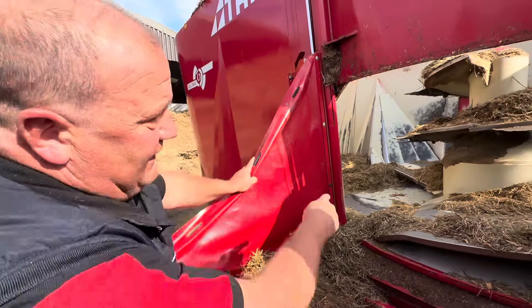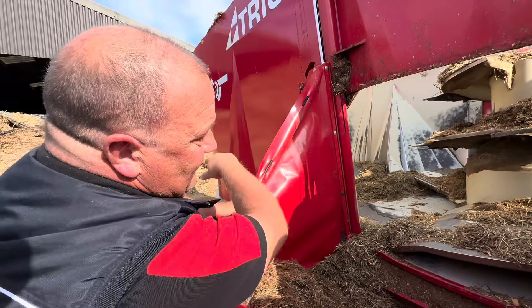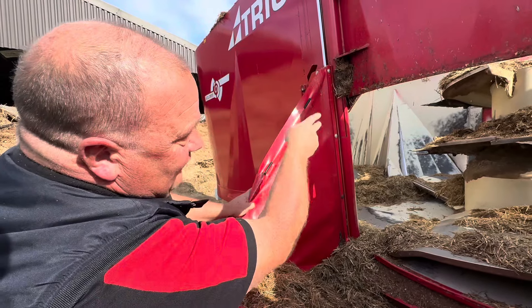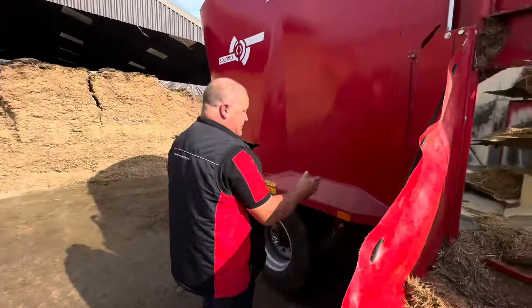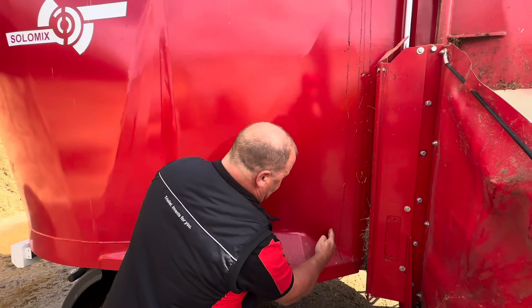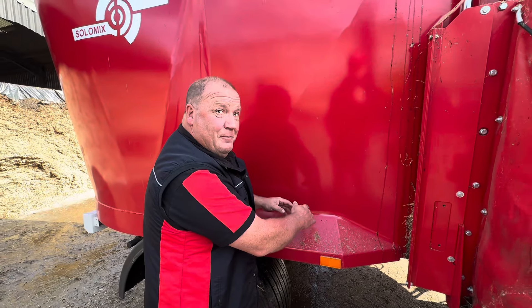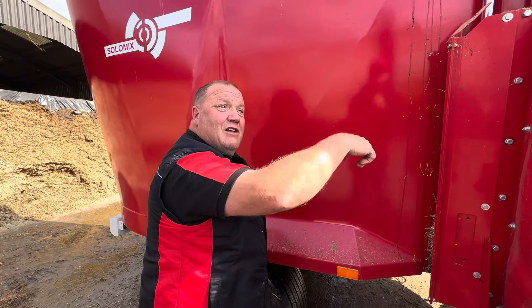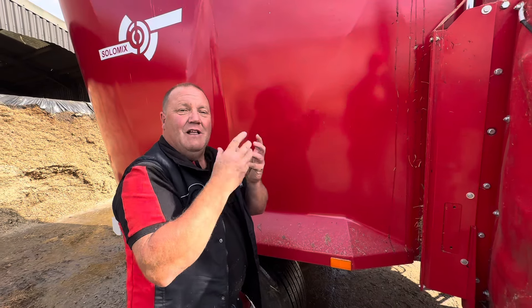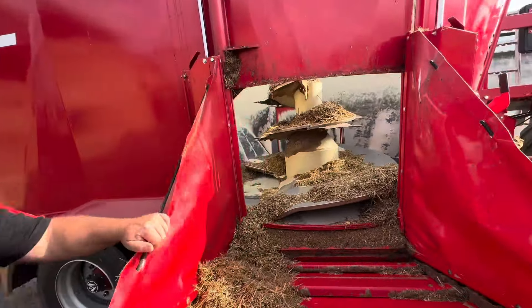While we're here, you can make out the wedge inside — it's actually asymmetrical, steeper on one side than the other. Apart from building a kind of cavity at the top so the product flows over horizontally, more importantly when it touches the floor: on this side it touches the floor about here, but on the other side it touches the floor about eight inches further back. So when the auger comes round it has to flow onto that front auger — it cannot create two individual chambers. It has to move in a figure-of-eight, it's got to keep moving, it can't do anything else.